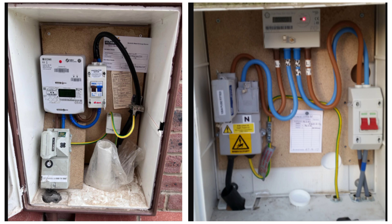In case of a fault in the main cables, this fuse will blow, disconnecting supply to the wiring including the meter. So this fuse also protects the energy meter from damage due to excessive current. Before the introduction of prepaid meters, this is where the electricity supply authority would disconnect the main supply in case of unpaid electricity bills.